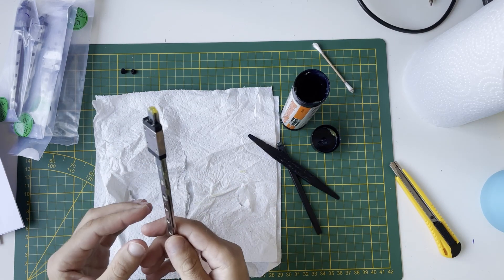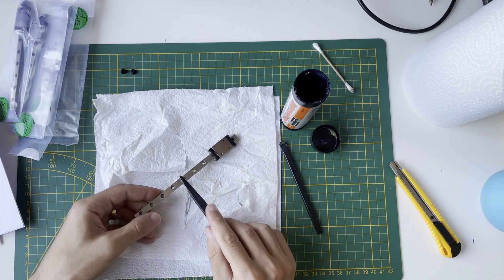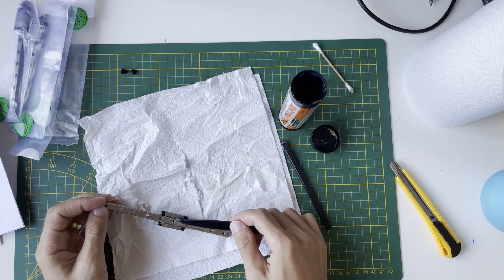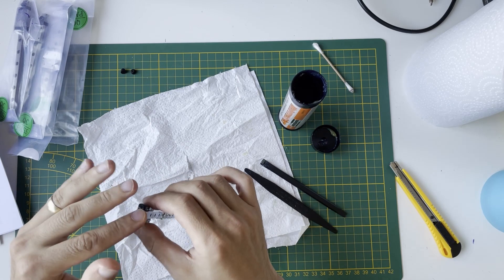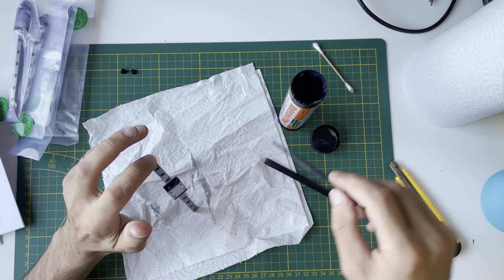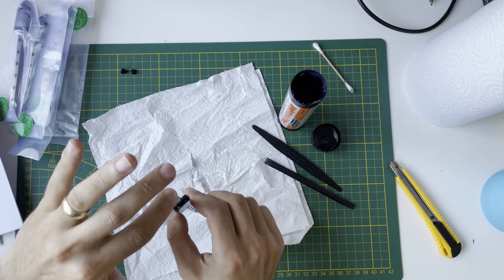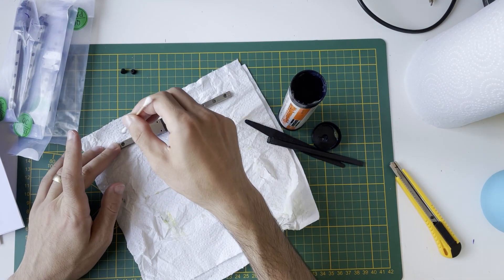If you are removing your carriage, check for excess grease — luckily there is none here. After applying, just move your carriage back and forth until you are satisfied with the movement. Apply grease on the rail, then take out any excess grease inside the holes.